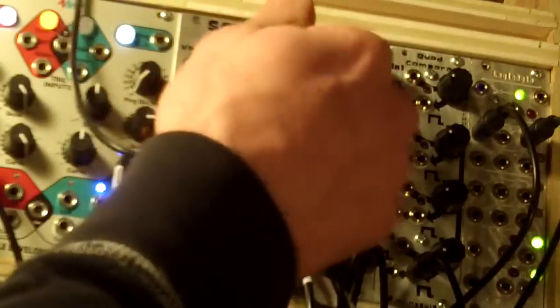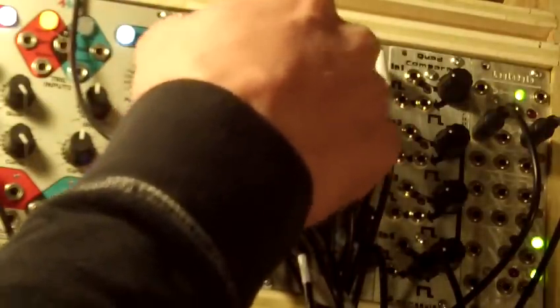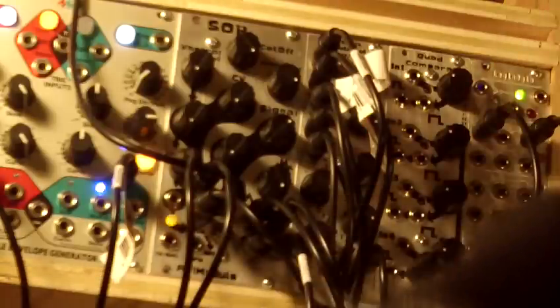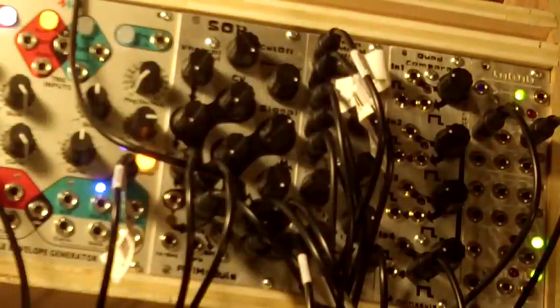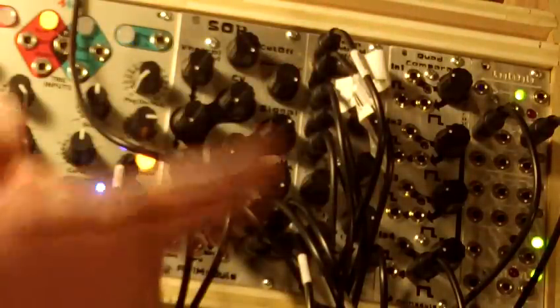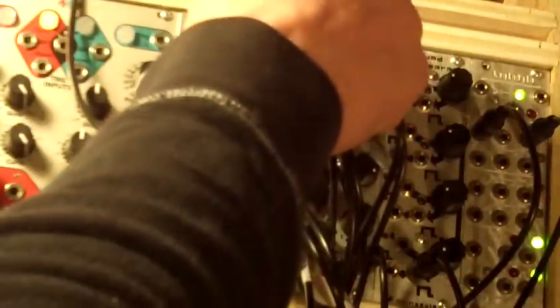There's a VACTROL input — you're probably wondering about that. Let's send your signal in through a VACTROL. For instance, when I modulate this, I'm just going to be using an output from an OR gate — it's approximately plus 5 volts, just a square wave, on and off. Most VCFs will click on that. What the VACTROL does is add a little bit of an envelope to it, slewing it so you won't get all the clicking and popping.